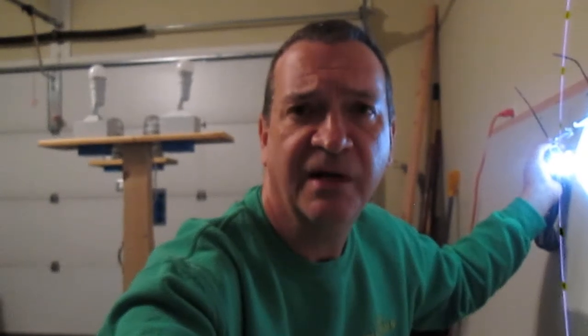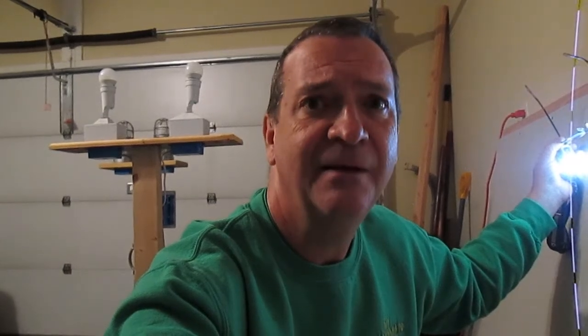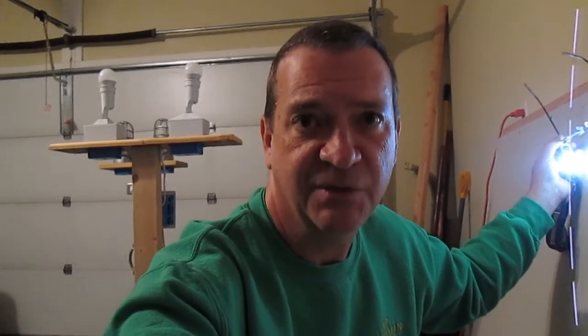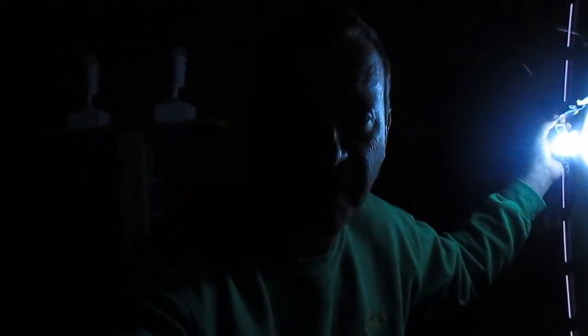I did mention before that I was going to give you little tricks and hints whenever I came across them. One of the things I do when I drywall is, when I think I'm finished sanding, I pull out a little flashlight, dim the lights in the room, and shine the light on the sanded area to see if there are any bubble holes or bigger scrapes I couldn't see visually or feel with my hands. I'm going to show you what that looks like — pulling the camera over to the sanded area to inspect for nail holes or anything like that.